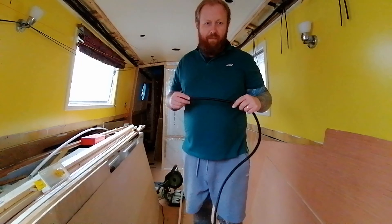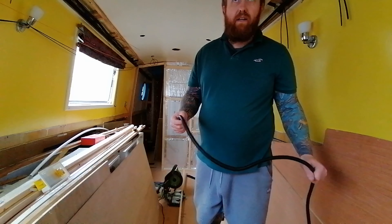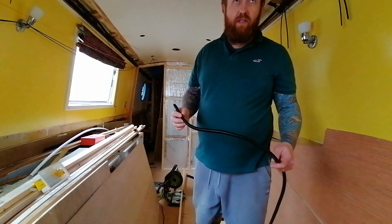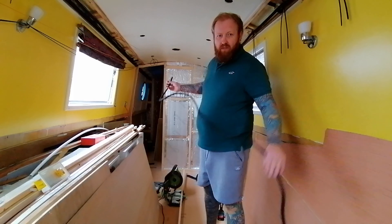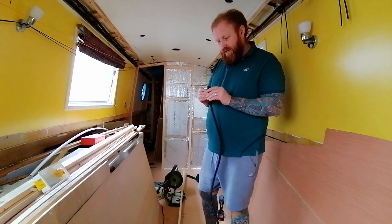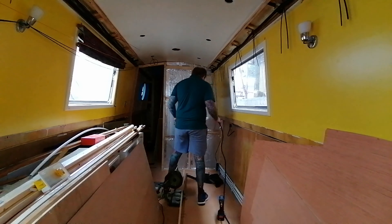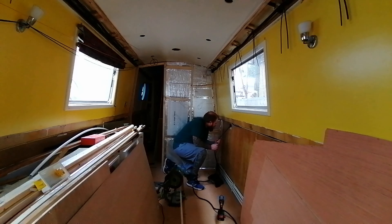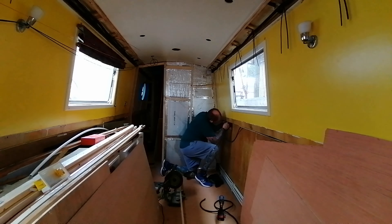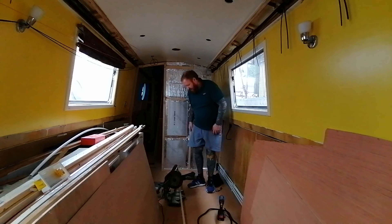What I've also purchased from Amazon is some 10mm split conduit. I'm having trouble going over the existing ceiling with the gap that's there at the moment - the only way I could get over it with 20mm conduit would be to take it down and cut some of it out, and I'm not doing that. So I bought some 10mm - about 10 metres of it for about 10 or 11 quid on Amazon. Hopefully that'll do the trick and also protect the cable going inside the gunnel as well. Here's my 25mm bead.